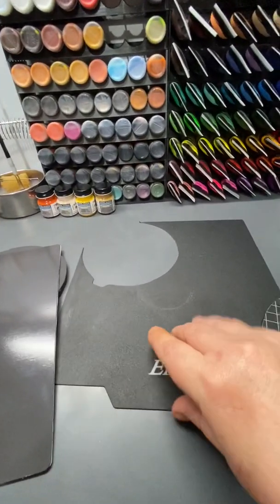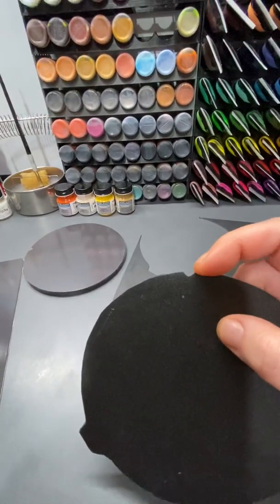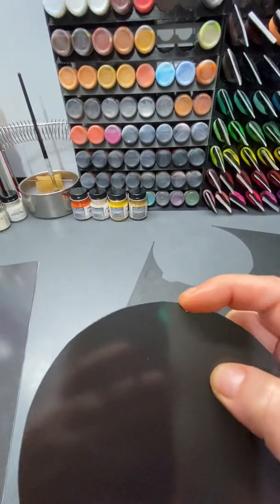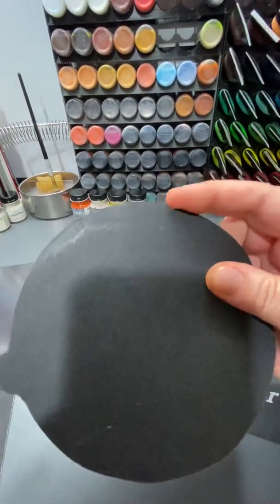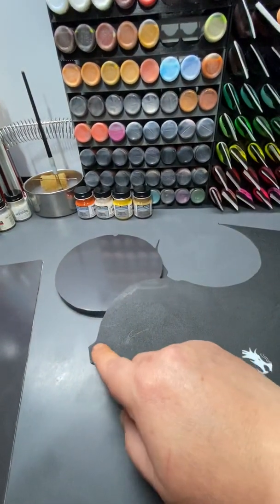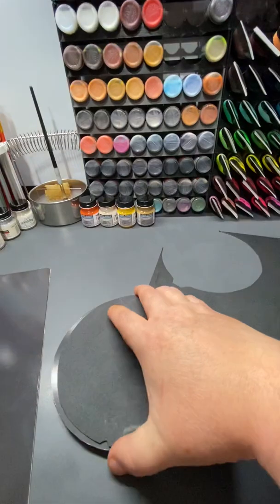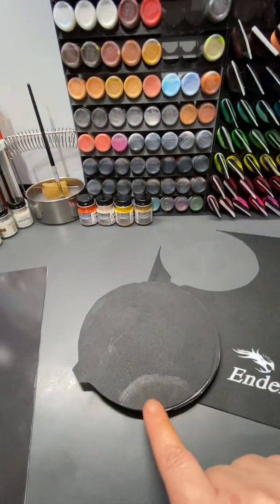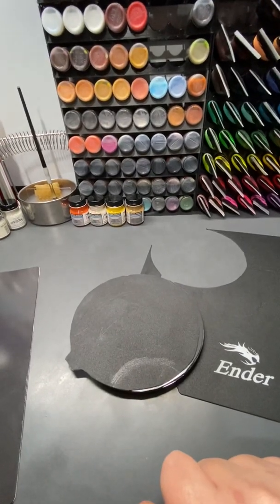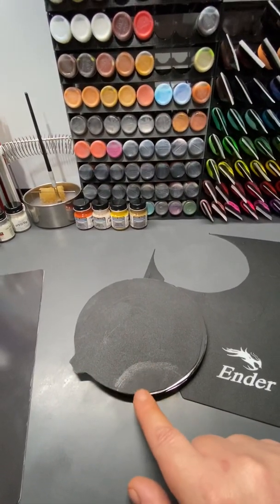On the textured top build surface piece, make sure you leave that little notch sticking out. Make sure when you're cutting you leave that notch on your build plate as well. You want to keep that notch because it helps you realign everything and ensures the build plate goes back in without any problems. The notch also helps you easily reach in and grab the build surface to remove it. You can place the notch anywhere except the very front edge, because that's where the nozzle comes out and extrudes the first section of filament — it drags back and you don't want to interfere with that. If you're left-handed put it on the left; right-handed, put it on the right.